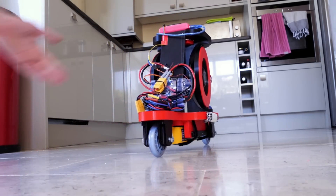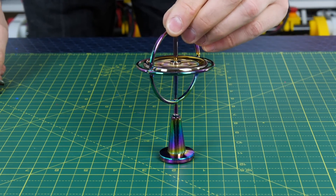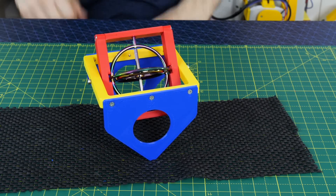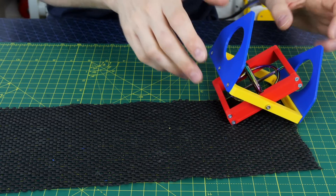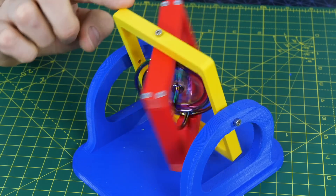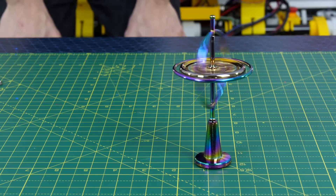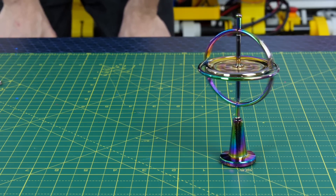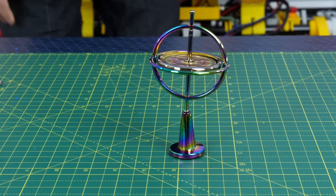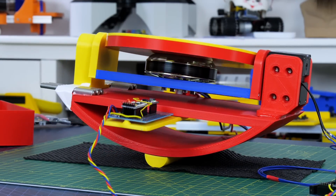I previously experimented with some small stabilizers which use gyroscopes to make wheeled robots balance, so that seems like a good place to start. A spinning mass produces something called gyroscopic precession. We've all seen spinning tops standing on their ends. However, if you start locking any of the axes in place then they won't stand up anymore, so we need to be a bit more clever if we want to use a gyroscope to stabilize a robot and have control over it. If we move one axis of a gyroscope then the precession causes a force in a perpendicular axis, because the spinning force and the control axis force combine resulting in a force 90 degrees around the gyroscope in the direction it's spinning. When a spinning top is balancing it's constantly precessing, constantly falling in one direction, but the resulting output force is 90 degrees around in the direction it's spinning, and as a result that makes another force 90 degrees around again. So we see this motion which makes it constantly wobble as it constantly falls. However, if we constrain one control axis we can use the gyroscope to exert a reliable force in a perpendicular axis as we wish.